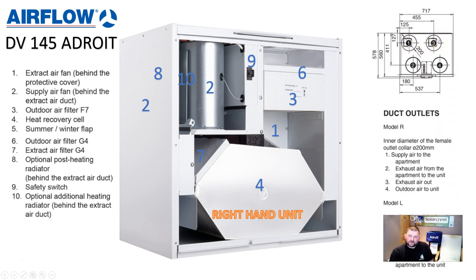Number three is the exhaust air out — this is the air which goes out through the exhaust vent, either on the roof or on a wall, constantly taking stale air out. Number four is the intake, which is constantly pulling in fresh air from outside. If it has got little bits of pollen in it, it gets filtered out by the F7 filter and also the pre-filter for bigger particles. So we can guarantee that the air coming into the property is always fresh, oxygenated air rather than breathing in stagnant air with all kinds of nasties in it.